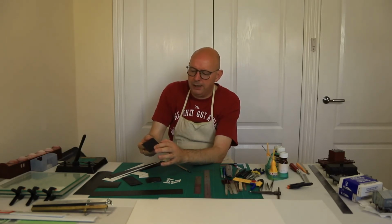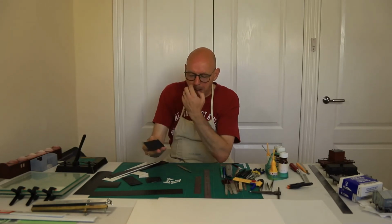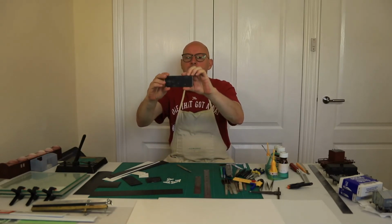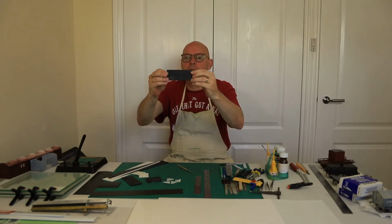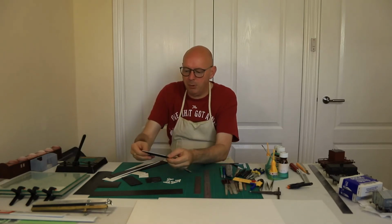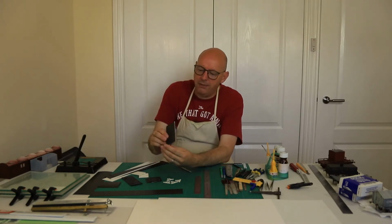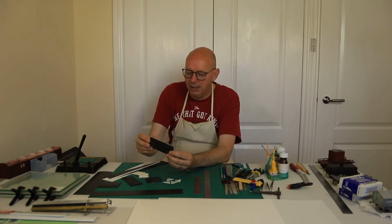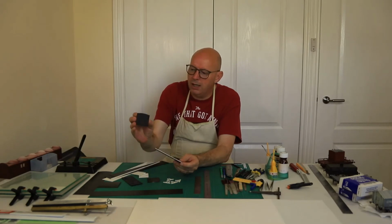put the holes, and then on the next layer I moved them up half a millimetre, and then on the final layer I moved them up another half a millimetre, which then allows you to have something that looks flat on the front, but then, as you tilt it, it actually gives you a proper lamination. Now, this particular piece, I probably laminated about 2 years ago, and I've been using them on my demo stand, never actually getting round to assembly.